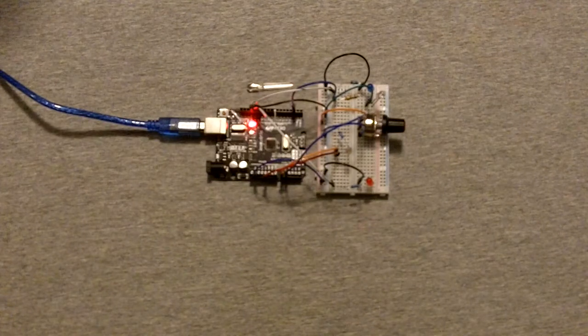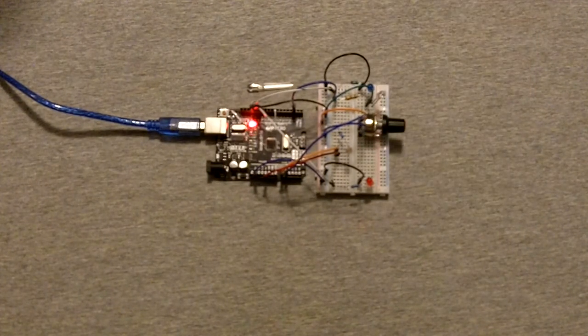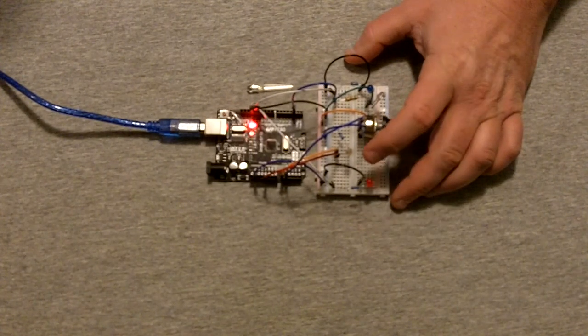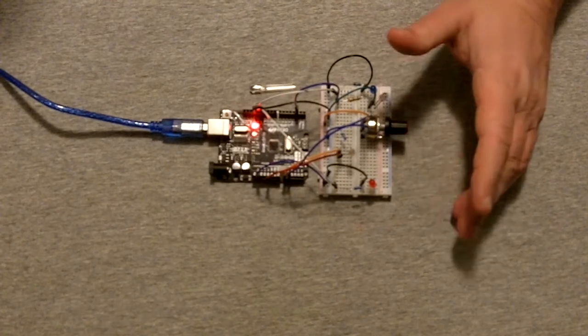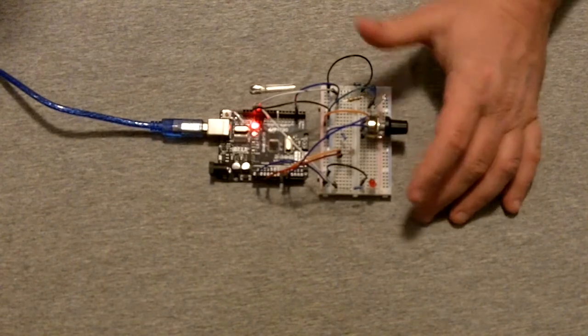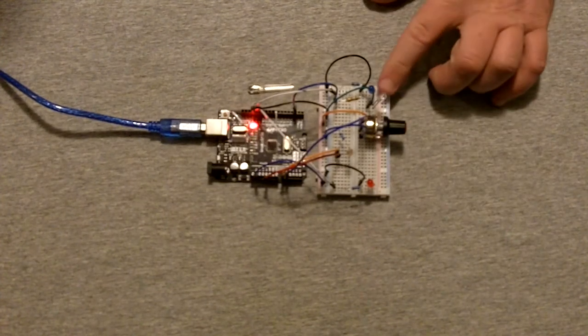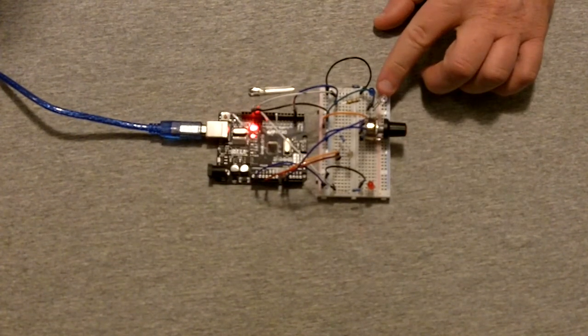In yesterday's lesson, we went over using the photoresistor, and we wrote some logic with an external function that we were able to jump out to from an else statement that we had in our code. We were able to monitor the incoming light and write a counter that would build up until it reached 100%, and then it would trigger or flash an LED. And then I got a little fancy and I created a blinking LED for when it was in partial charge, and a blue LED that would light up and stay on when we reach 100%.